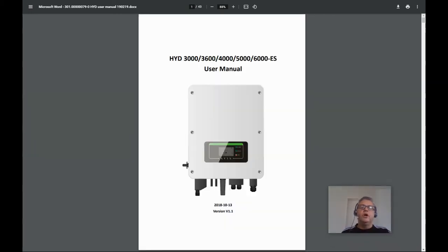In summary, when choosing which size inverter to use, you'll also need to give some consideration to how much load you want to allow for, as well as the size of the battery pack to allow for sufficient time to charge the battery. As a guide, my reading of the specifications suggests you want the same or more solar generation than battery capacity. So if you wanted 5,000 watt hours of battery storage, you'll want a minimum of 5,000 watts